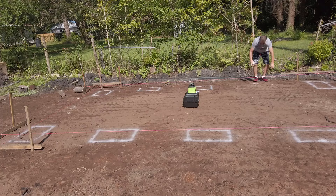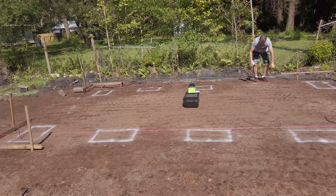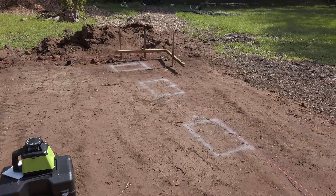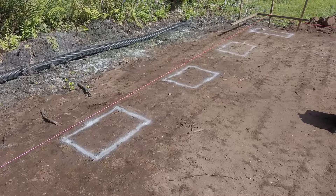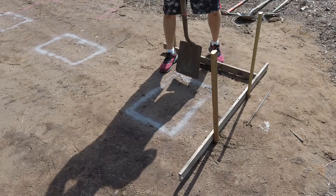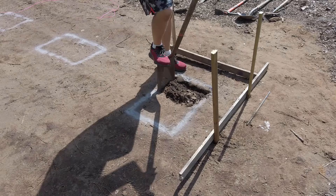Same thing for my length. My footers are 16x24 inches. I've chosen a 4-foot spacing between piers, which means 5 footers per load-bearing wall. That is overkill, not going to lie — I could have done fine with 4 footers per load-bearing wall, and probably by code could have gotten away with just 3. For depth, I need to be 12 inches below the frost line, and as I said, we don't have a frost line here, so I just need to go 12 inches.